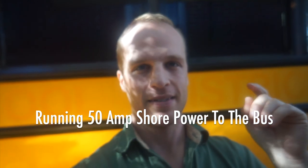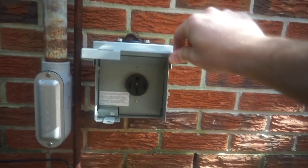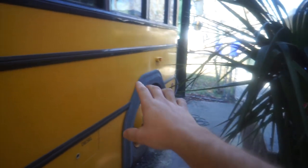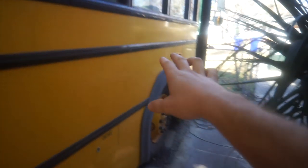Welcome back bus converters. Today is a big day. Super important — we're very ready for it — electrical power on the bus. What I have here is a 50 amp plug-in that was installed by a real electrician. This runs back to my panel and takes a regular 50 amp cord that will run power to a shore power connection on the other side of the bus. Today we're going to add a shore connection, add a 50 amp main breaker panel, and wire to a 100 amp sub panel.